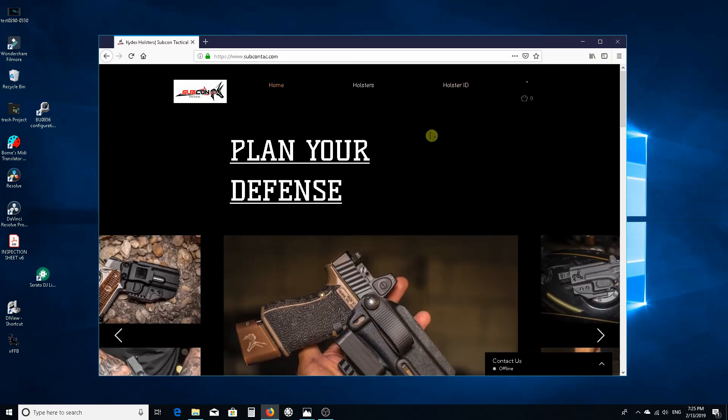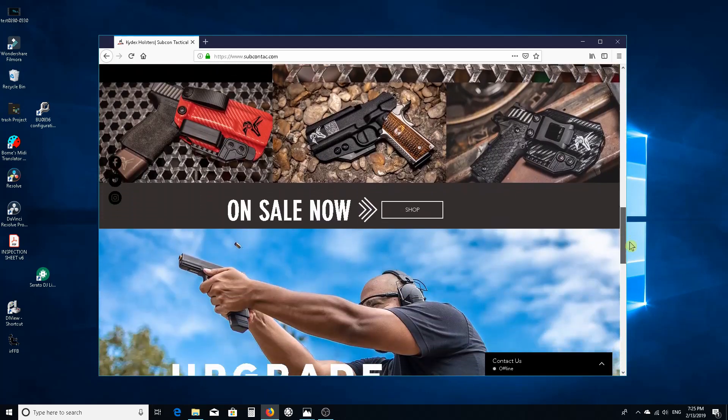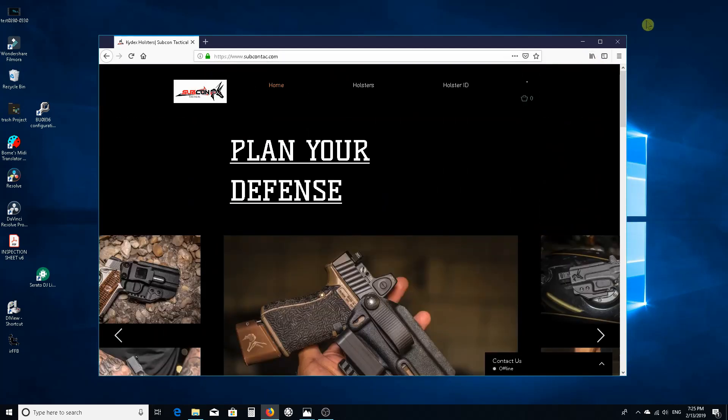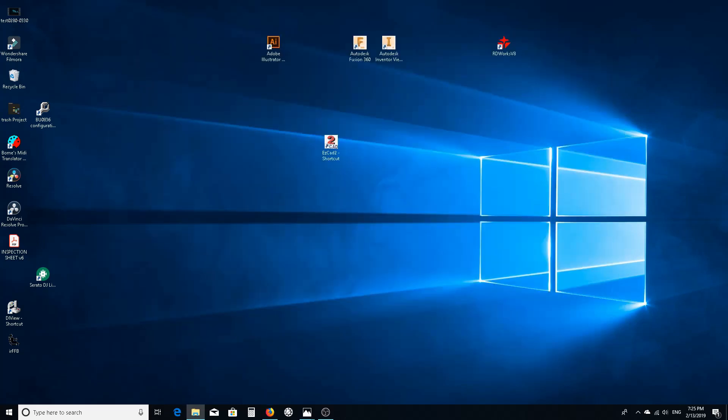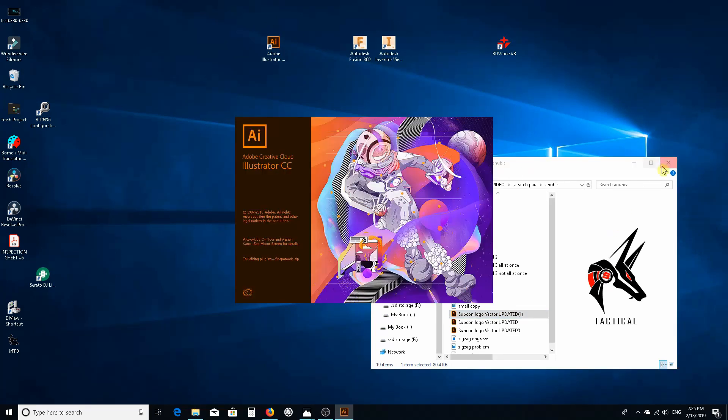I told them sure, since it's usually anodized it should come out nice and clean, and asked them to send me the artwork. It's always nice when somebody has artwork that's almost ready to run. Unfortunately, artwork that's good for print is not always good for laser engraving. What they sent over was an AI file, which was convenient — AI files are already vector files, so it's not like a bitmap or JPEG that I'd have to vectorize.